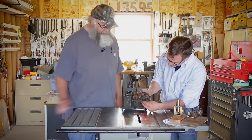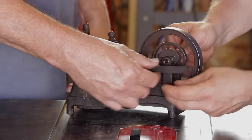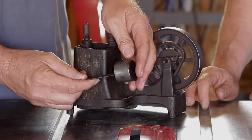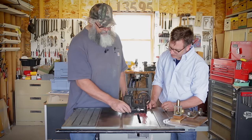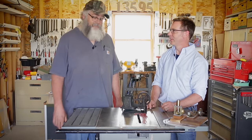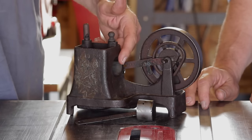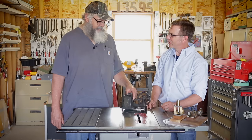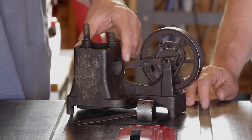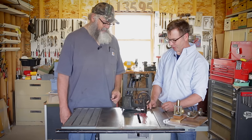The crank disc is off right now. The piston on this one is in pretty sad shape. These things don't have enough power to overcome very many obstacles, so things have to be about right. This one's worn in the bore. I'm probably going to have to bore it out because it's got, I think, about 3/1000ths taper. It needs to fit pretty close. Yes, you can't lose that energy, can you?